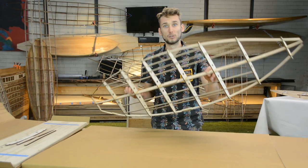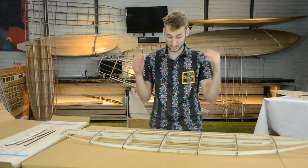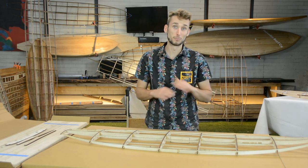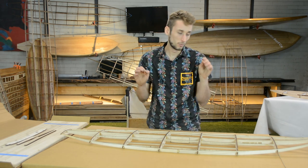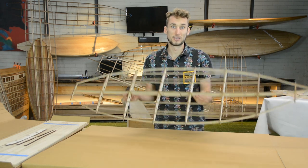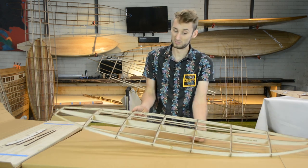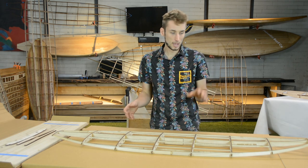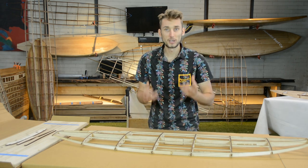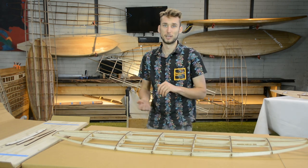Now you'll notice that the frames look quite a bit different. We've gone deep into the rabbit hole of old Paulownia surfboard kits, so we have done away with the plywood frames and now we are built entirely out of solid Paulownia. What that means is the frames are lighter, more eco-friendly — not using plywoods that rely on nasty glues and chemicals — but also a lot stronger, because we're using a thicker material which is also a lot lighter. So we're getting more bang for our buck.